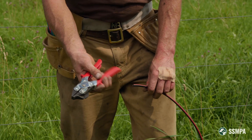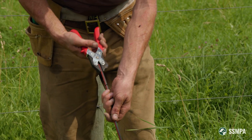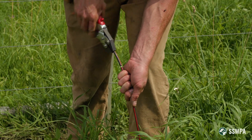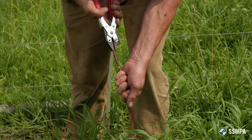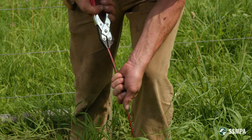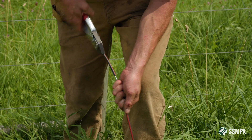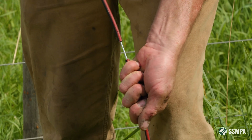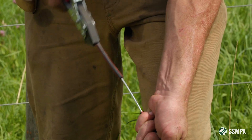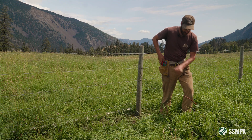I like these electric fencing pliers because they have parallel jaws — when you grab a hold of it, it'll hold firmly onto the whole jacket. You can step on it and then start to twist and pull it. Once you've got it a little ways off, you can pinch right onto the end of the wire and start pulling it off without putting any additional pressure on the wire. It takes a little bit of force. If you can't quite do this, you can strip it off with a knife — I'll show you how to do that at the next ground rod. We're going to use one continuous wire to hook all these up.